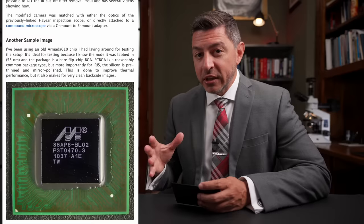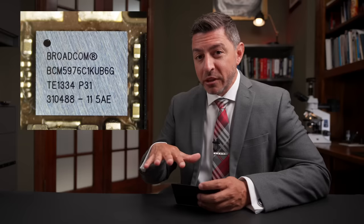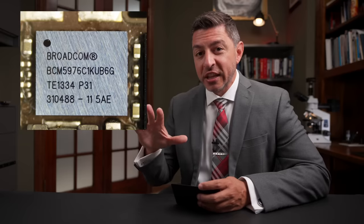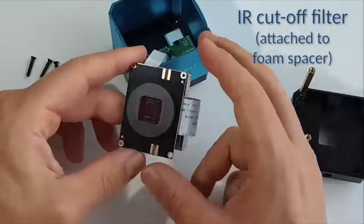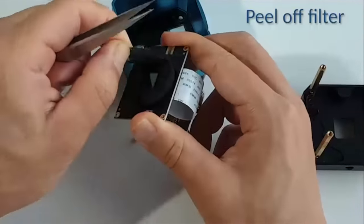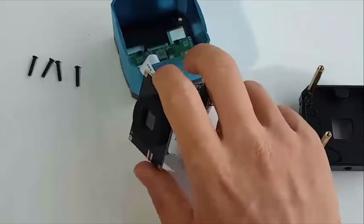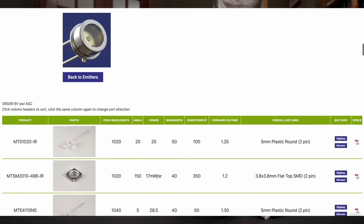This means if you use a camera and infrared LEDs, you can actually see inside of the silicon — see the structure and verify that the part is what it says it is on the outside. This is only for flip chip type devices, where the pads are on the bottom. They flip it over, put it on the board, and the top of the chip is just the silicon itself. If you take a camera, remove the IR cut filter, and use a certain range of IR LEDs — if it's too low, below around 1000 nanometers, the chip won't look transparent; if it's too high, like 1200 nanometers, the camera's imager won't be sensitive enough. He found about 1050 nanometers is the sweet spot, and he shows a link on his blog where you can buy these LEDs and a camera.